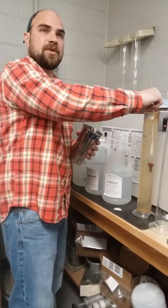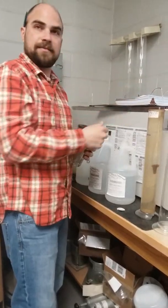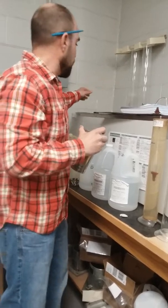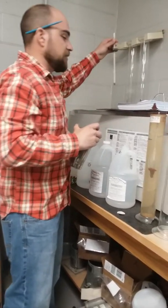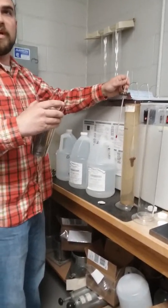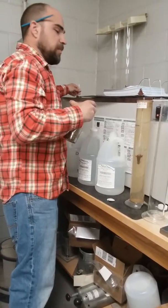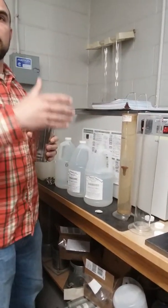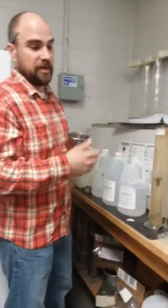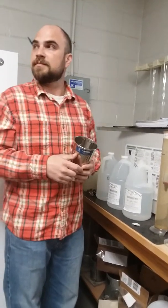Once we have that done, we're going to rinse all this material over our number 200 sieve. So it's kind of like we're doing a wash. Whatever's retained on that number 200 sieve, we're going to dry it out, and then the DOT has you do gradations on that material. What do you do for DOT here? 50 and 200, I believe it was, for a fine aggregate, and the 35 and 200 for a topsoil. And then that would be that.